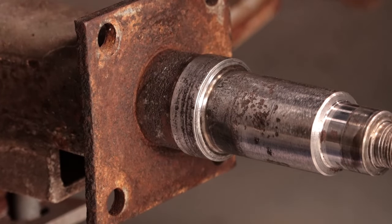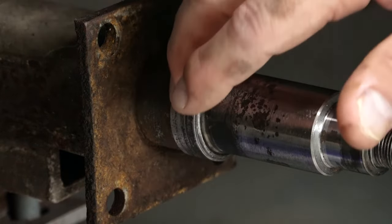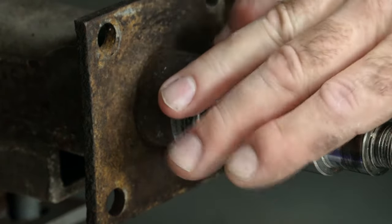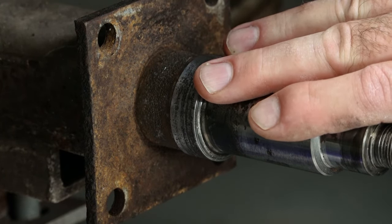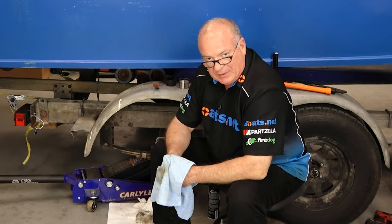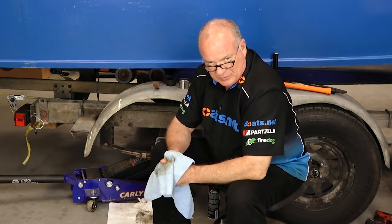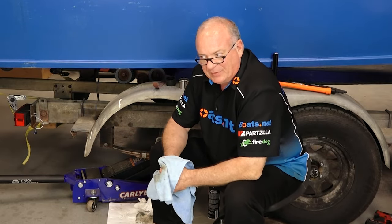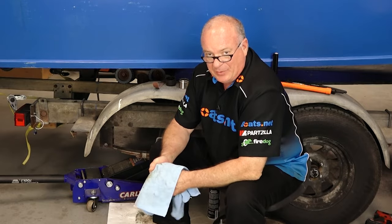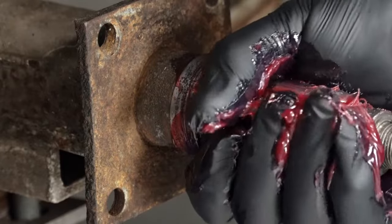I've got it cleaned up, but I can tell you it still has some pitting — I can feel it and I can see it. So that means it's going to eat through that seal faster than it should. That tells me next year we're going to have to do something about that axle. You can go through and replace your axle, or what I'm going to do to get a little more longevity out of mine is use some emery cloth and clean up that surface. For right now, we're going to let it go with that new seal and the new grease — it should make it through the season. But after that, I think I'm going to have to replace it. Hey, it's part of boat ownership. With this cleaned up, let's go ahead and get it greased up and put it back together.